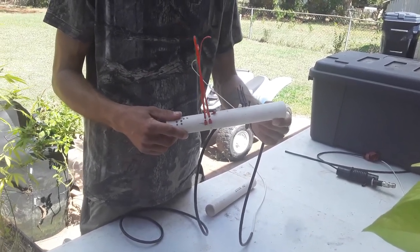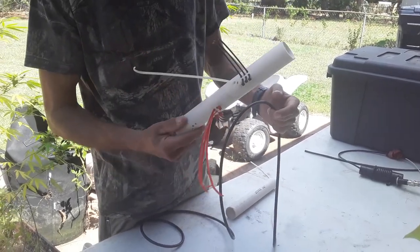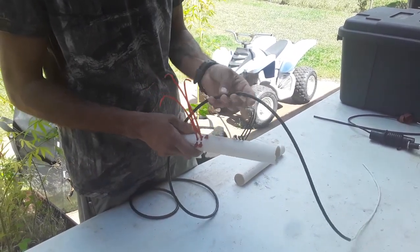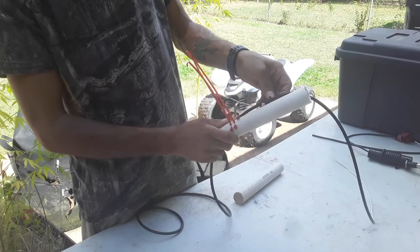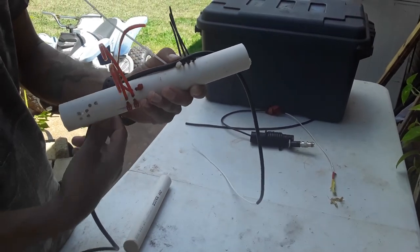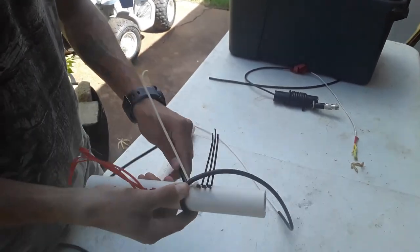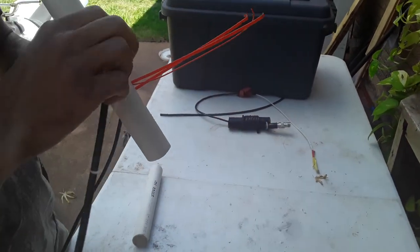And that would be the bottom of your coil. The reason I did that was so that I could mark both sides of my former here and have that all pre-drilled. If you don't want to pre-drill it, you can just rack your coil and then move that first layer to the side and drill your holes. It's super simple — I'm making it sound way more complicated than it is. What we're going to do is take our former that we've already pre-drilled and begin our coil, locating that first score mark. I'm going to put that first score mark just on the top edge of where we want our coil to start. We're just going to wrap nine turns, not counting the first one. Once you go around once, that is one turn — but don't count the first loop that you lay down there.